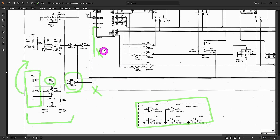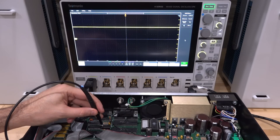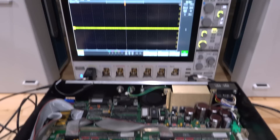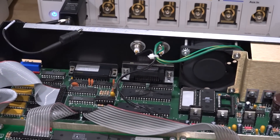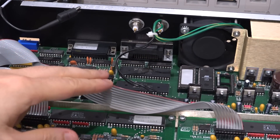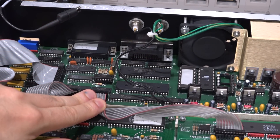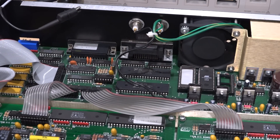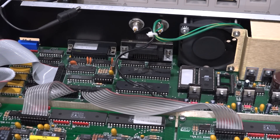Back at the board, pin 2 is just sitting high, so I'm reasonably convinced nothing is coming out of the clock generator. There's something unusual: that chip is the only one on a socket. I wonder why — is this a common problem with this unit, or did somebody else already work on it? Everywhere else chips are directly soldered, except for the programmable ones which must be socketed. Perhaps this is a common failure point of these units.